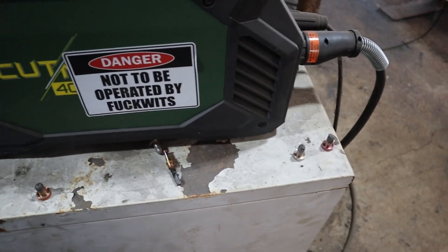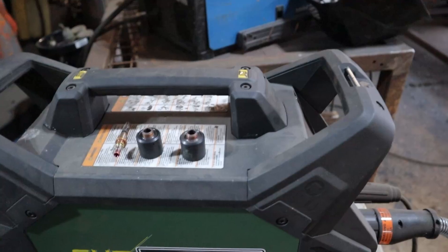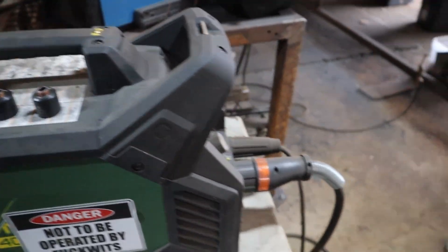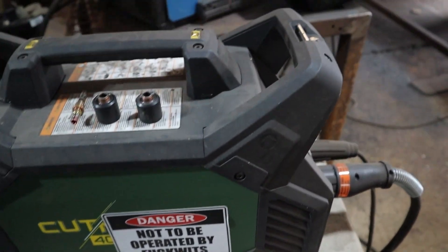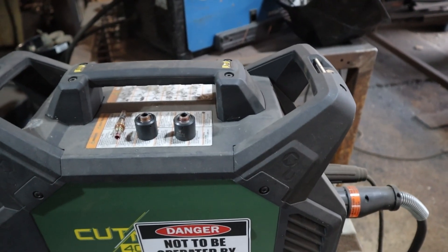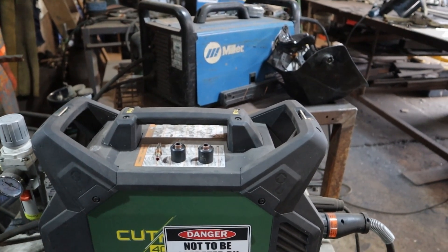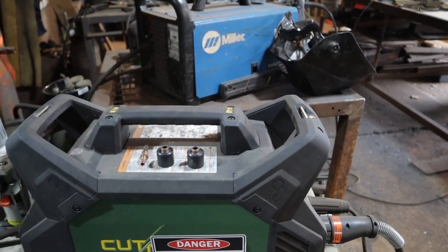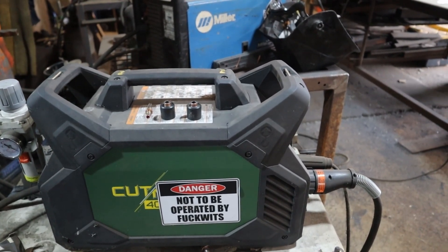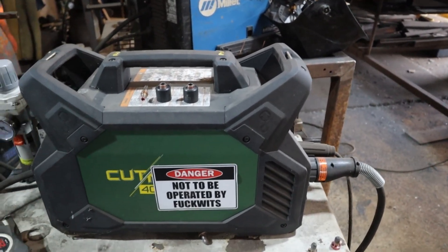These parts are about 90 bucks a pop. When you're trying to make a couple hundred dollars an hour cutting artwork and 90 dollars disappears every other day, that adds up fast. Tips and electrodes are expensive — that's where they make their money. The less consumables you burn up, the more profit you're making. My only recommendation on welding tips: don't go cheap. The knockoff tips will blow out so much faster. Spend a little more on genuine Miller or Lincoln tips — they'll last twice as long, sometimes three times.